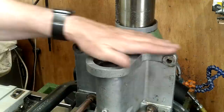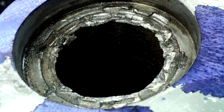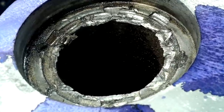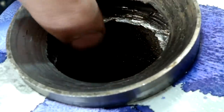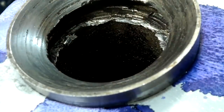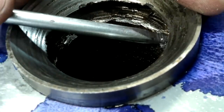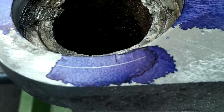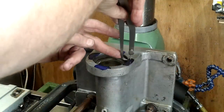Even after all that work I still can't cut the new bearing seats. You can see that the bearing seat is well marked up. This is because the original tapered bearing cup had a smaller bore than the casting, and the only way I could extract the bearing was by driving a butchered screwdriver into the casting in an effort to pry the old bearing out. This effort would have been vastly reduced if two simple swages had been cut to allow knockout access.